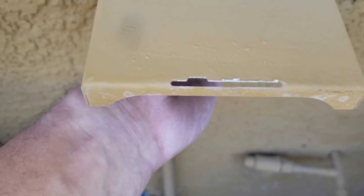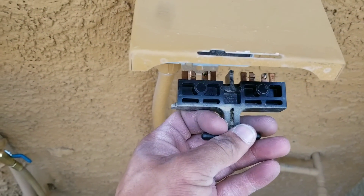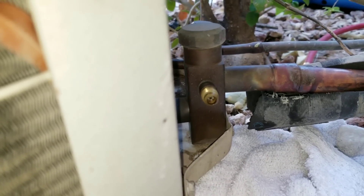I'm going to remove our fuse or disconnect and that's going to turn our system off. Sometimes when you're dealing with a leak in the system or low refrigerant, it's usually going to be due to a leaky Schrader valve. You can see here this is my leak detector and it's already just bubbling, and that indicates to me that the Schrader valve needs to be replaced.